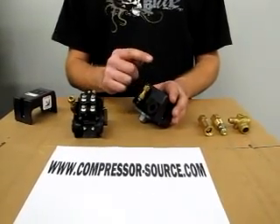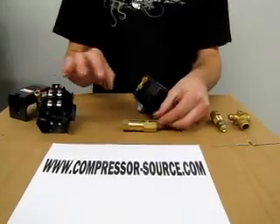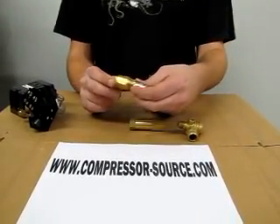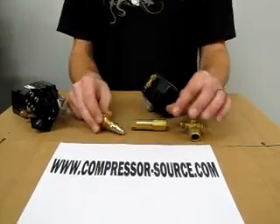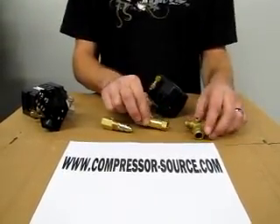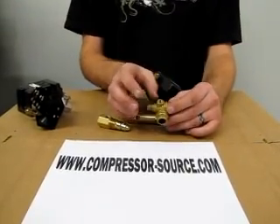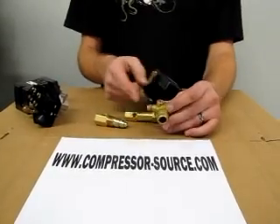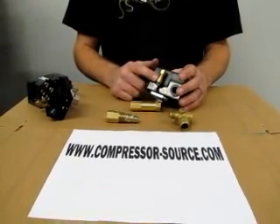This unloader line usually goes into the side of the check valve or the compressor head. Your check valve keeps the air in the tank — I have three different styles here so you can see what you might be looking for. The most common check valve sticks into the tank and this is where your unloader line comes in to the side, with your main line coming off your compressor going into this port. There is also an inline style screwed onto the side of your tank. On a lot of compressors made overseas you will see a type where the plunger is actually in the side. That would be what is wrong with your compressor if this unloader valve is leaking while it is shut off.